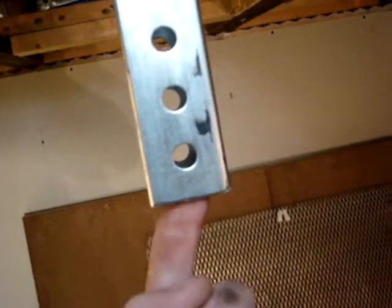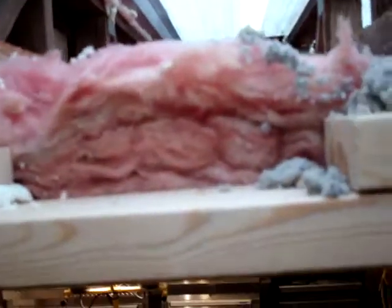This penetration is a source of air leakage into the unheated area outside the envelope. Because the area up here — there's some of the insulation. And down on that end, beyond the insulation of that void, is soffit vents, which bring air into the space above the heated area. And over down on there is ridge vents, which, in addition to a power fan, take the air out. So this entire area in the space is outside the building envelope.